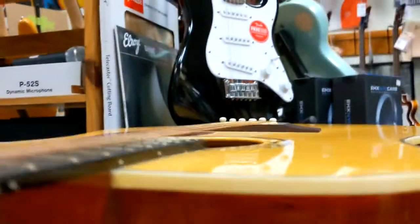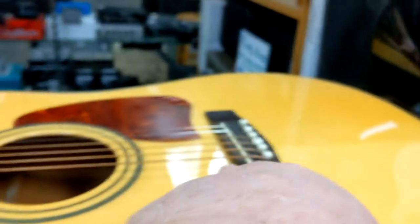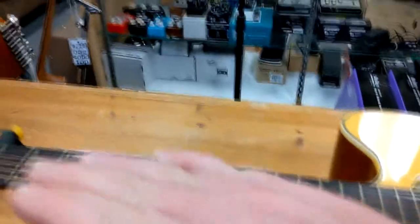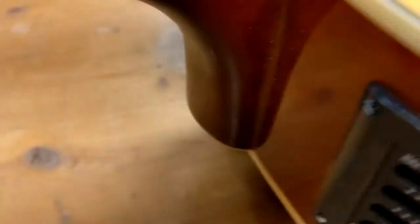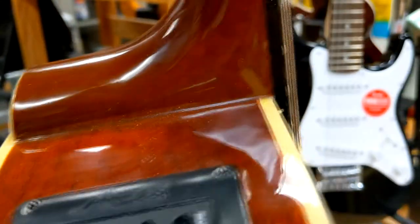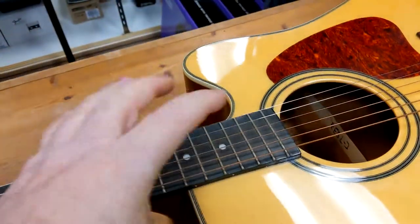Let's see if we can glance across the top there and see what's happening. To describe it: there's a belly here, there's a dip here, the bridge is rotated forward. The other half of that is the neck often tilts this way. It can do it two ways. On this plywood guitar, it's managed to just tilt completely — this is what we call the neck joint. This neck joint is not compromised at all, but the neck-to-body angle has changed. The entire neck block and top, everything associated with it, has just shifted.